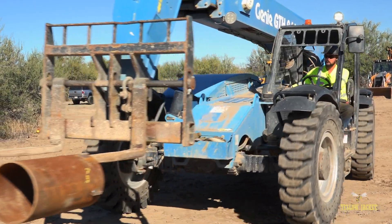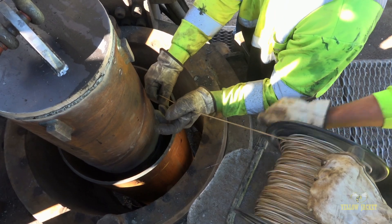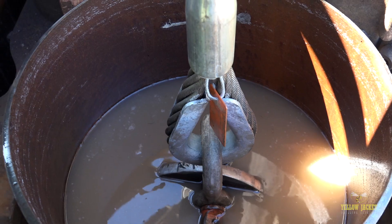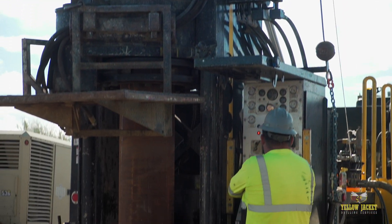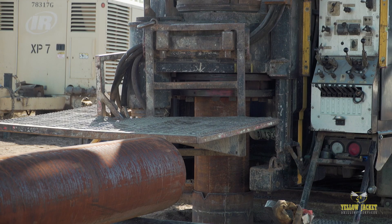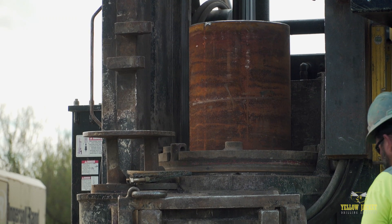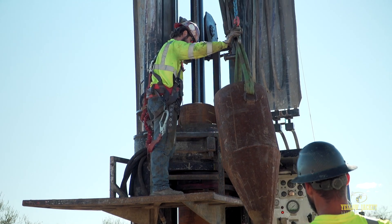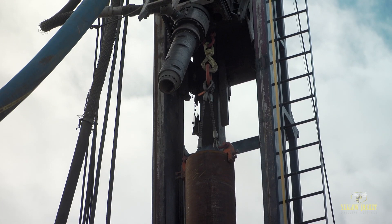In addition to drilling without additives, the DR is ideal for those situations when drilling through multiple water bearing units and cross contaminant mitigation is key. When preventing cross contamination, the dual rotary approach has the ability to stop advancing casing in bedrock and drill open hole. The DR is capable of seating the casing into the bedrock, obtaining a much superior seal between formation units compared to other methods.